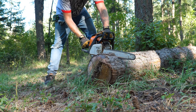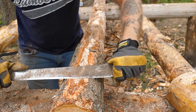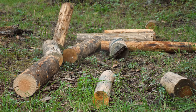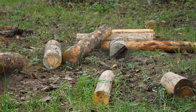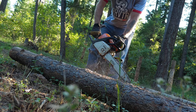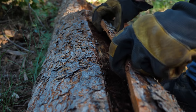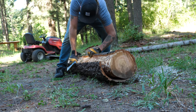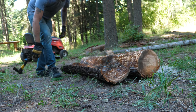Before I do that though, I need to remove all the bark from these poles. If I don't, ants will make a lovely home in them and destroy all my hard work. Since I started trail building, I think I've found the best way to remove bark. For most seasoned wood, ripping a line down the entire length of the log with your saw will save you probably 30 minutes of hatchet swinging. Once you have this line, big pieces can be removed at a time by peeling up from inside the score — meaning less manual work and easier cleanup. Another amateur pro tip.